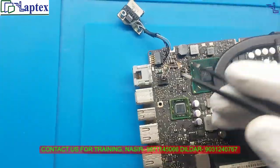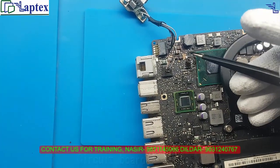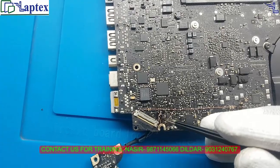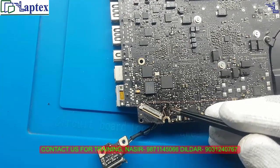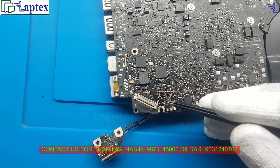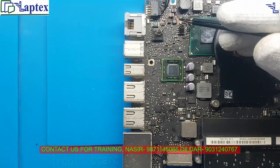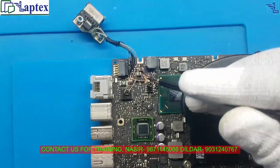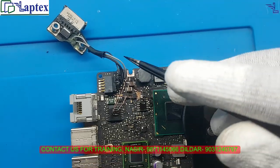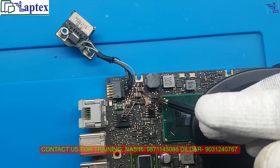I made the track for the LPC address. This is the area of the LVDS backlight enable switch I used here. You can see what I have done — here are two resistors: R1 is 100K and R2 is 47K. For the ground, I have taken it from the same place where it used to be connected on the switching area.